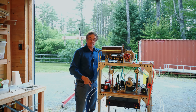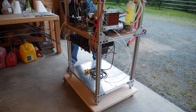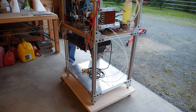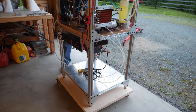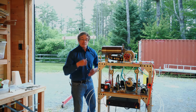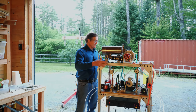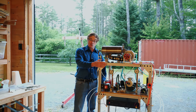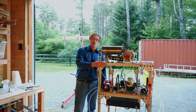I carried that through to the bottom of this stand as well. I cut a second panel of equal thickness and just cut out little corners to allow it to be slid in and bolted down, just like the top panel. This serves a couple of purposes: it strengthens up the frame so we're not standing on spindly little legs, and we can put fuel and supplies down on the stand. More importantly, the jet engine makes a substantial amount of thrust at the top end, and if you build it tall like I did, it would have a tendency to tip. Having a plate down there would allow you to put a couple of bags of sand or some gravel at the bottom to heavily weight it down and prevent tipping.